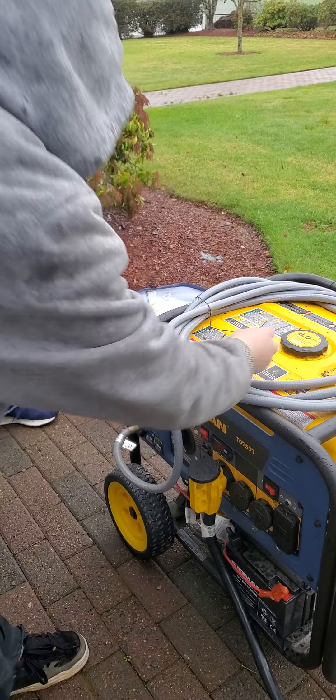Okay, we turn off all the breakers — just start turning them off. Now turn the master breaker off. Now shove that aluminum thing up — see that aluminum? Shove that up. Now you can turn the other breaker on. That's the generator breaker. Now that turns on the generator power. Now start turning them on one at a time.